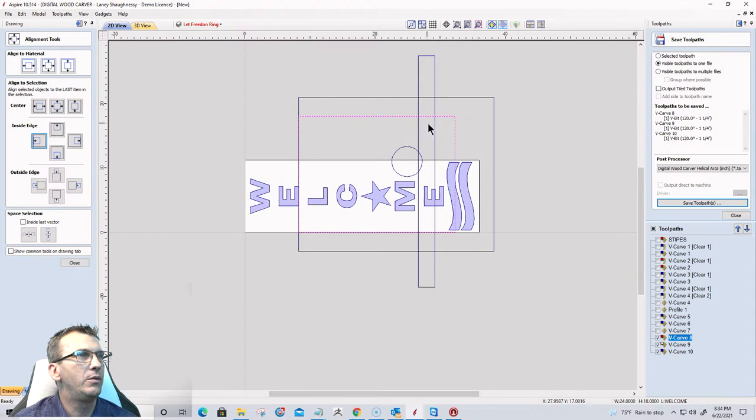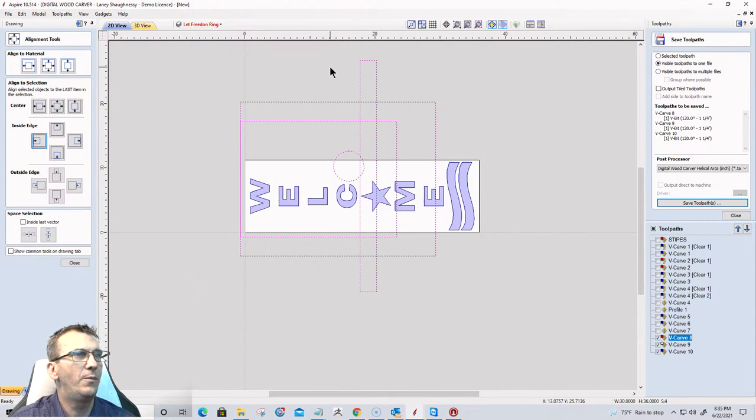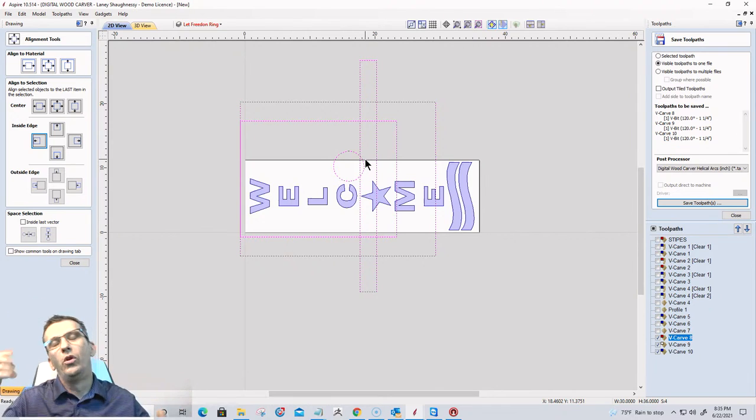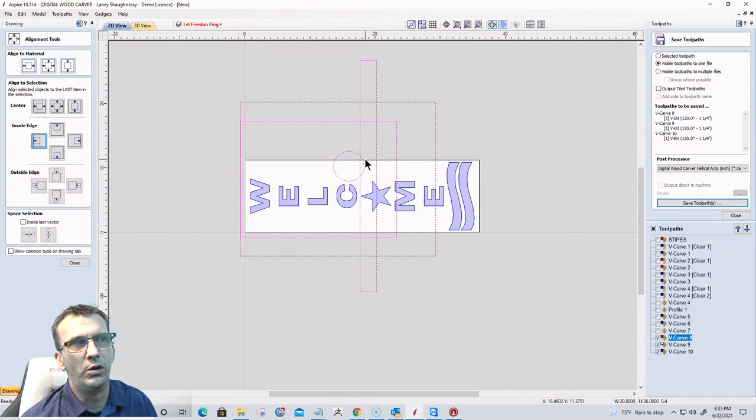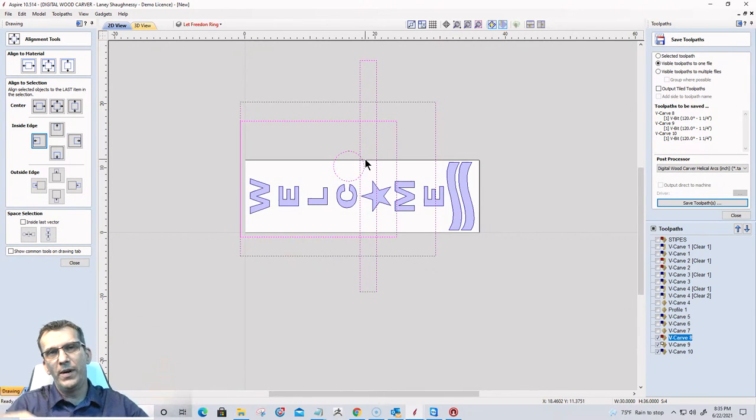Now, I'm going to take my CNC here and get the starting of my board on my table. There we go. Now, what I do is I have a Swanson ruler. I bought it at Lowe's for $9.99. It's a 48-inch ruler, about 2 inches wide, roughly, and about an eighth inch thick metal ruler. That ruler, I have holes drilled in it so I can secure it right to my T-track or to my wasteboard, depending on what I have there. And I do have T-slots in my wasteboard, but I can secure it right down. I want to make sure it's running square with my table.